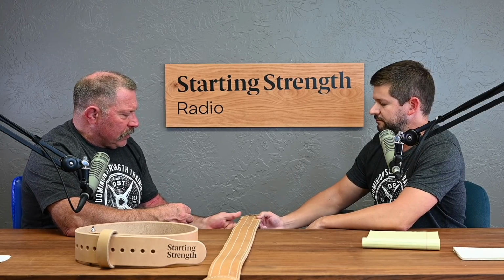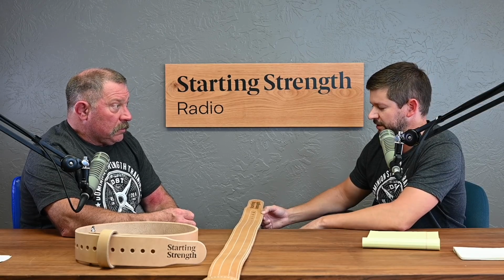Yeah. So if you guys have calculated the size of the hole, the curve that size makes, and the size of the buckle pin, these don't tear. They don't. We've never had anyone, though they might ovalize slightly to begin with, and that's fine as long as it's not cutting through the punch. Yeah, and that's just due to the fact that the hole is punched vertically, the prong is trying to go through at an angle, so it's going to deform slightly on the top and bottom, but it should stabilize.